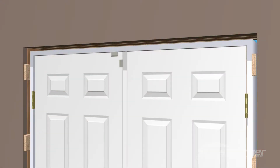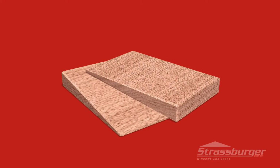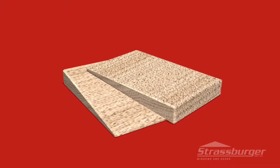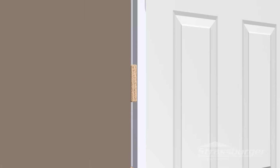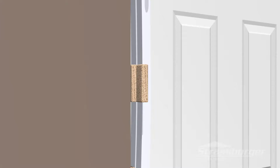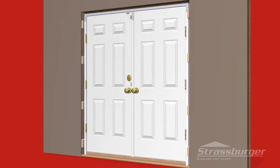If the door is loose in the opening, you may add additional shims to help secure the top of the frame in the opening, keeping the top of the door frame flush with inside of the finished wall. We recommend always using shim material that will make full contact to the existing shim and the door frame. These shims should be placed carefully so the frame of the door does not bow or distort. Make sure to keep the hinge side of the main operating door slab plumb and level at all times. Do not rely on the existing structure for plumb.